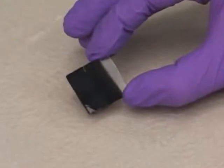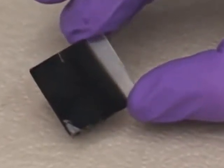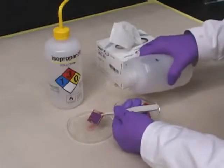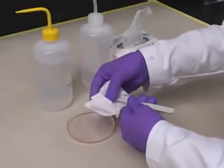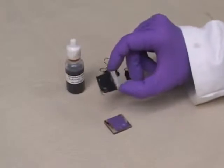Step 5: You have now made a carbon-coated counter-electrode. The carbon coating on the slide is very fragile and is easily rubbed off — be careful not to touch it. Part 6: Assembling the Solar Cell Device. Step 1: If the stained titanium dioxide glass slide has been stored in vinegar, carefully remove it. Rinse the slide with water and then with ethanol, then gently blot it with a tissue. Step 2: These two slides — the titanium dioxide coated slide and the carbon coated slide — will be sandwiched together to make a solar cell. Both slides have a 4-millimeter strip on one edge that is clear of any coating. The slides must be assembled so that the coated areas are touching each other completely, leaving the 4-millimeter empty strips exposed on each side. These two exposed edges will serve as the contact points for the negative and positive electrodes.